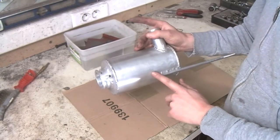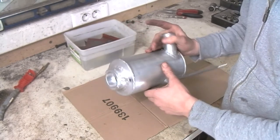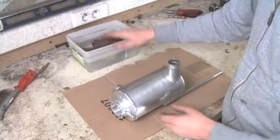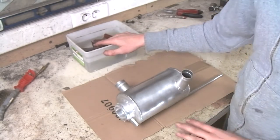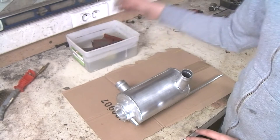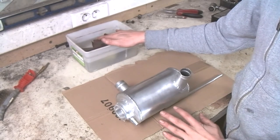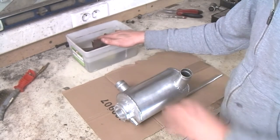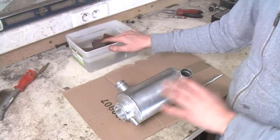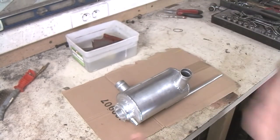As you can see the finish is quite rough because I wasn't very careful with it, and I also used a wire brush to clean it before welding, so we have quite a few streaks and some scratches. Here's a tub of water with some sandpaper in different grits - I've got 400, 800, 1000, and 1200. I'm going to use these to completely sand this, starting with 400, then 800, 1000, 1200, just to get all the scratches out. Once everything's sanded as smooth as I could get it, then we'll polish it by hand.